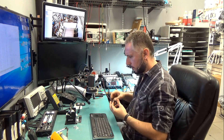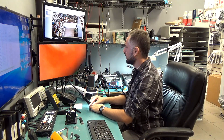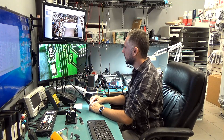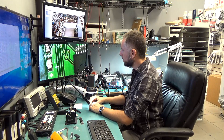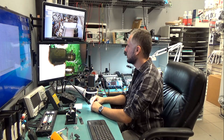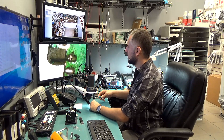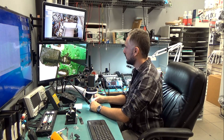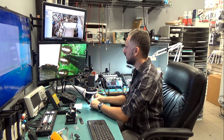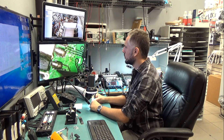Alright, where is the other piece right there? So this is the circuit board for the USB flash drive. I do not care about the components on the board for now, but I want to look at the connector. Look at this — I see broken pins. One right here. This should be soldered onto this. I cannot tell if this is loose or not. This one looks broken off.